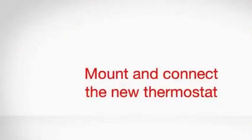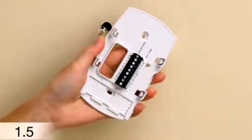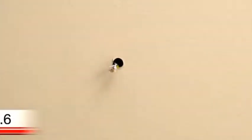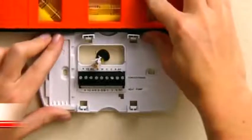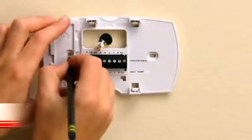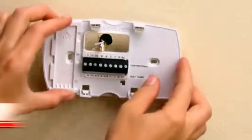Now it is time to begin installing your new thermostat. First, separate the Wi-Fi thermostat from its wall plate. Set the thermostat aside and begin mounting the wall plate. Position it so the wire hole is centered and pull the wires through the hole. Now is a good time to verify it is level. Using a pencil, mark the positions of both screw holes on the wall. If you don't already have holes in the areas you marked, you'll want to make pilot holes for the screws and anchors.